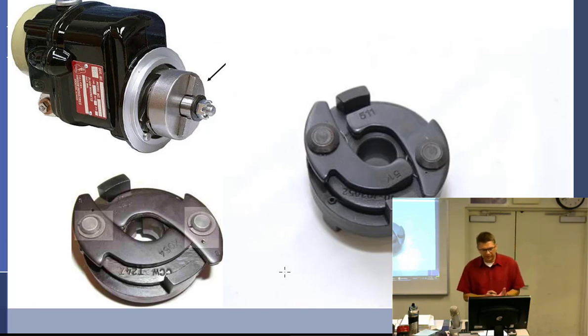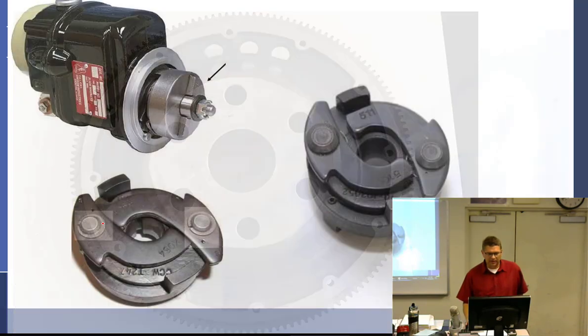All right, impulse coupling. So here we have a slick magneto up on the picture. We have this one down here in the lower left and right. The one up here, these are riveted pins. These are the snap ring pins that you guys have asked about. So this is the older style with the riveted, and there was problems with these rivets coming loose. When that came loose, this little piece flew into the engine and that made a mess. These are the new style with the snap rings that don't create quite such a mess.